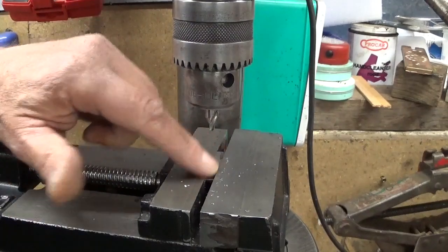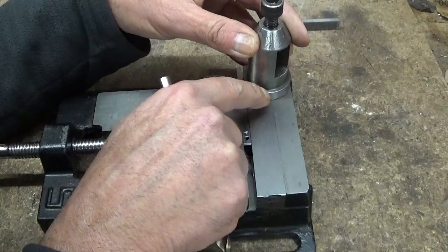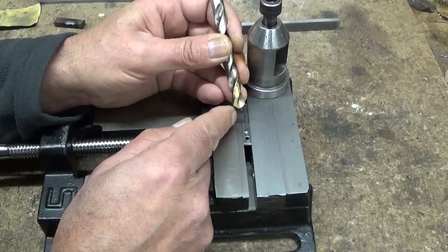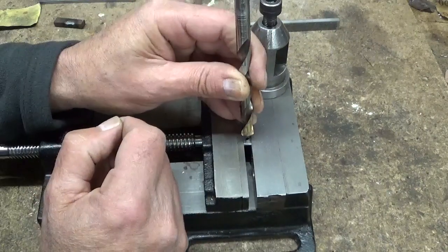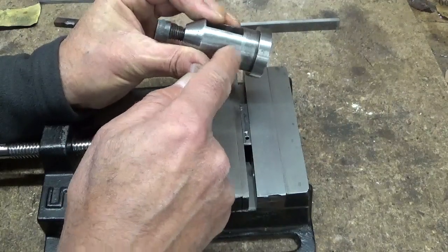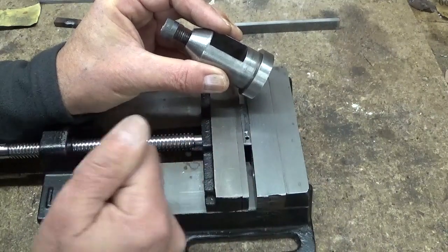It even made a very tiny little chamfer. That's a double win. But I don't have the good tools to make this flat thing here. So I'm gonna use a 4 millimeter drill. Now this is way too big, but just to show that I'm gonna have a 118 degree angle in here. So when I'm gonna make this part in the lathe, I'm not gonna make this recess in a shoulder, but also 118 degrees. Well, that's theory, of course.